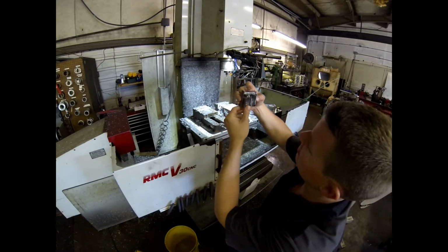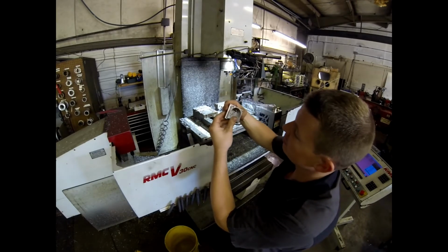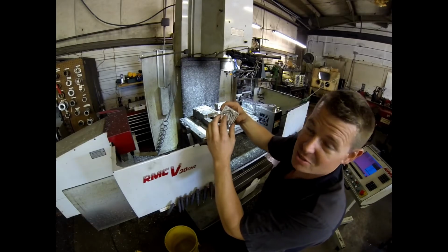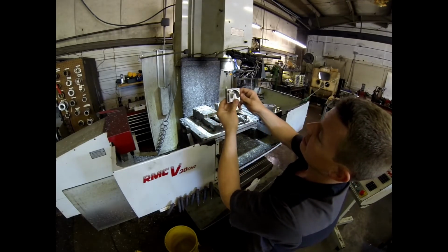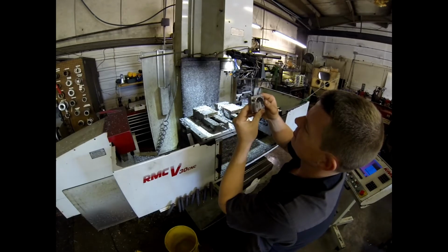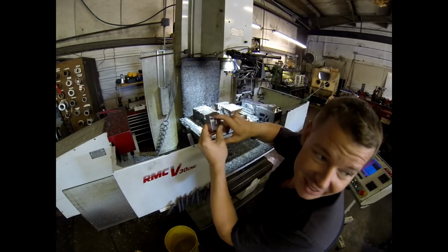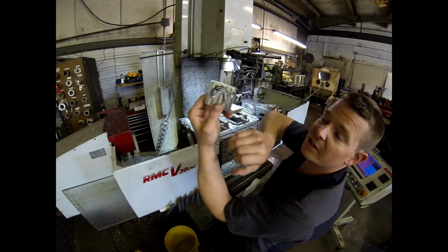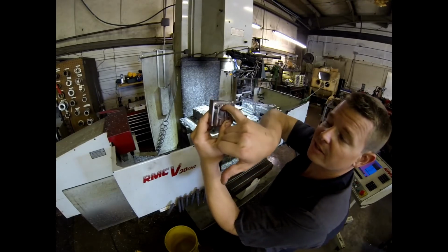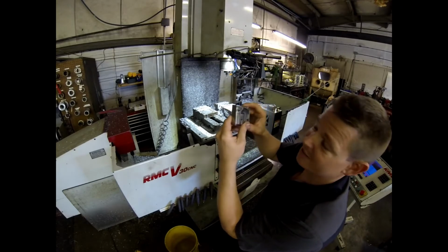So that hole is going to get milled off on the backside. That's where we drilled. That was actually supposed to go all the way through to allow some coolant relief, try to get rid of some of those chips, but it's thicker than I have drawn for. So it didn't. It's hard to tell yet what that's going to look like. I didn't want a sharp edge on our little hook for our cap. It looks pretty sharp, to be honest.